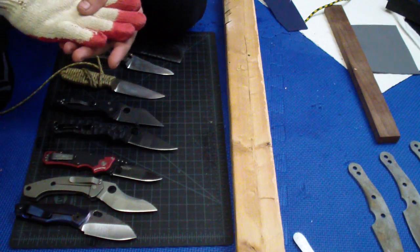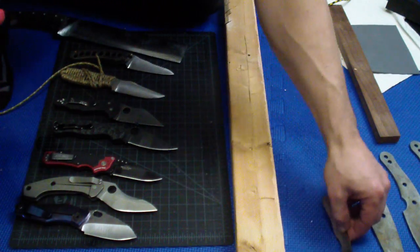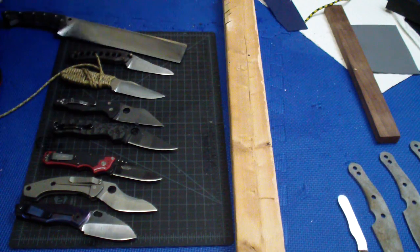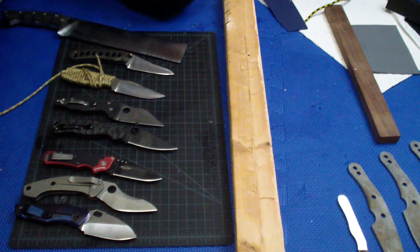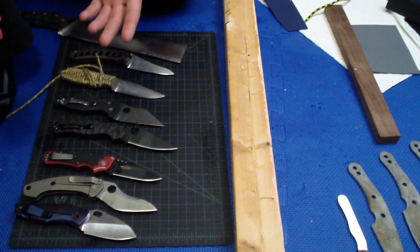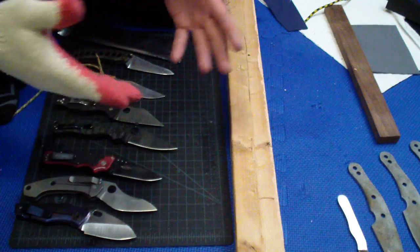There's a lot of different things that are based on opinions in knives, you know, it's personal preference, what do you use the knife for, etc. But knife grind is something beyond just the personal preference. Personal preference applies to how thick you want your knife, the spine, the stock, because of what you use it for, what blade shape you like, what steel you like and stuff like that. The grind is actually one of those things that there really is such a thing as the best knife grind, just generally. There are certain things where one certain grind will perform better for certain tasks, but as a general, on average, Convex is the best one.